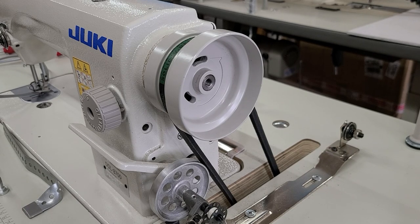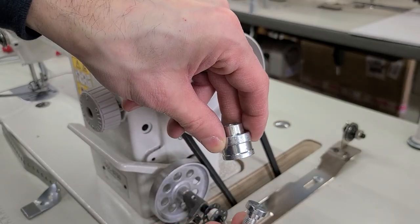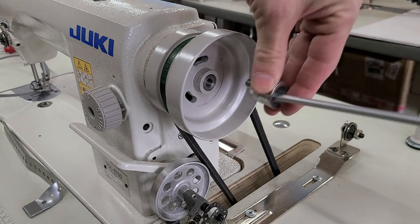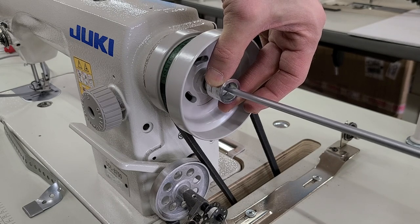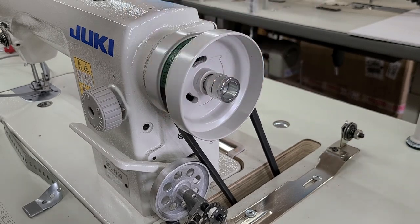I've repositioned by the hand wheel here. I am going to install the adapter with this large screw. The motor, if you didn't get it from me or the synchronizer, will come with two of those screws. Make sure you use the one that goes in nice and smoothly. Do not try and force this into the shaft of the machine because this is delicate in here — you could ruin the threads if you use the wrong screw. I'm using a slotted screwdriver. Hold the wheel, turn, and that's as tight as you want it.